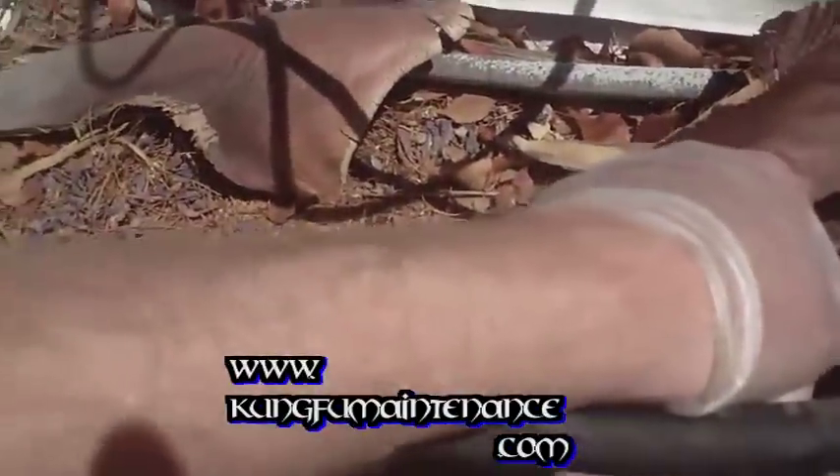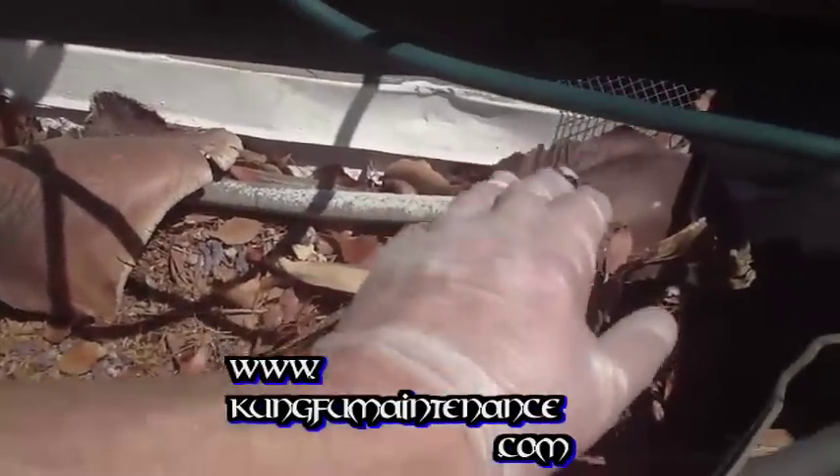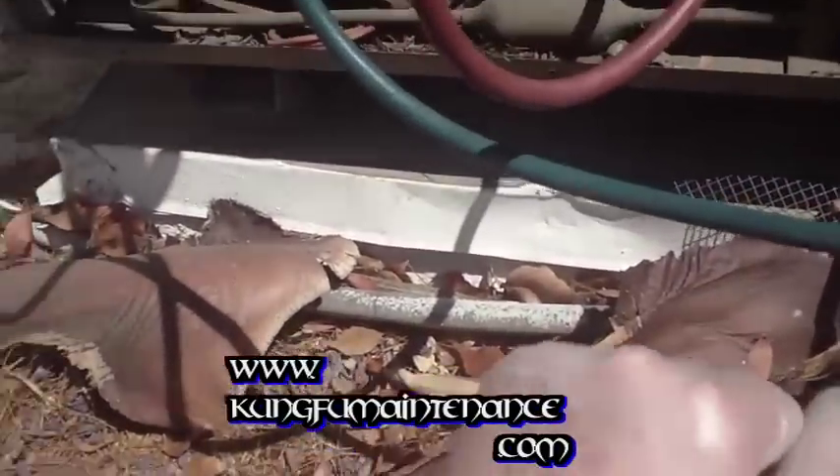Here I'm feeling the line with my wrist on the suction line side. I can usually tell by feel when it's starting to get cold. What we're looking for is for it to flash — when it flashes it's really ice cold — to charge the unit up.